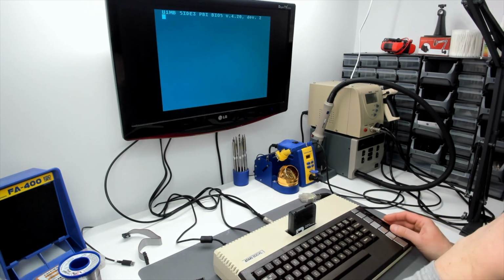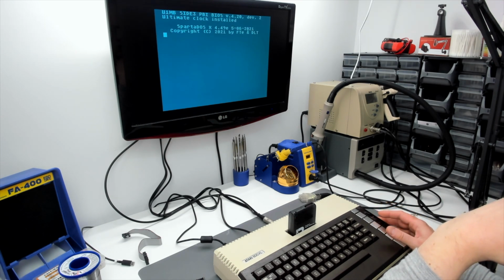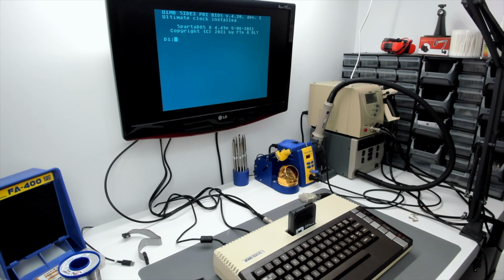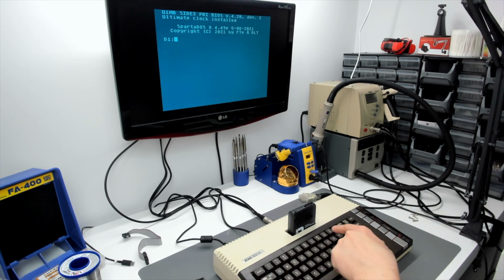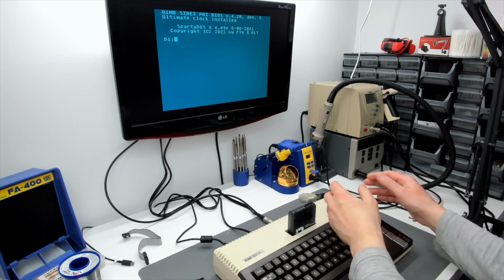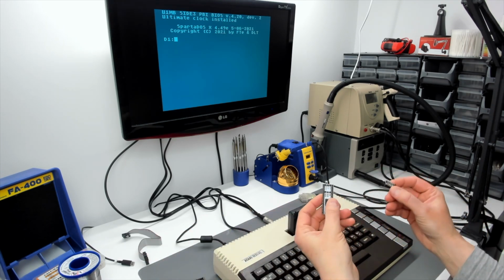So if you press system reset in classic mode or with Rapidus actually turned off, the thing's going to reboot or hang, worse. But am I going to undertake to try and diagnose this after 5 or 6 years of experiencing this problem and initially being called a conspiracy theorist before everybody suddenly agreed that it was actually a problem? No, I don't think I am. The way to get rid of the unwanted cold reset problem is to take Rapidus out of the machine. Trying to work around it with all this bullshit.